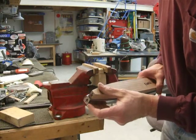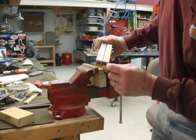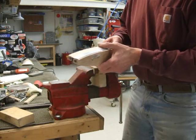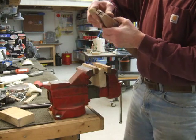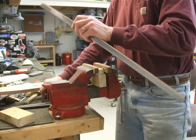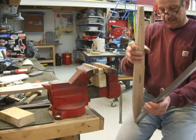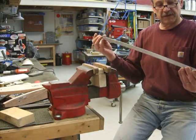You can see the difference where the form block is. Without any capturing on a form block, the metal just tries to go wherever the path of least resistance is — that's why there's this funny little end on here. That's going to be ground off because it has to fit the tubing. When you pull it out, just wiggle it a bit — one pin, two pins. It's going to be really snug against the form block. Pop it out, and there you go. Form block undamaged, and a nice clean rib. The next step is to put some flutes in it and get some lightning holes.